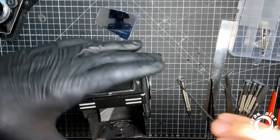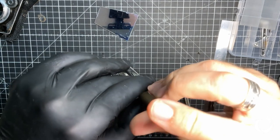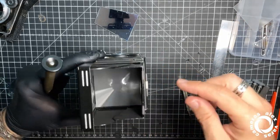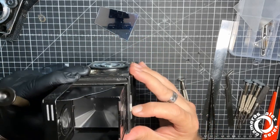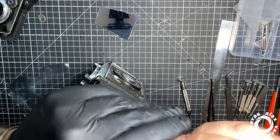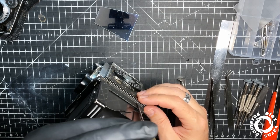These old Rolleiflexes, I mean the model 3A, 3B, have a provision where you may drop a Fresnel lens over this one. Okay, and this is installed in the finder, but you can drop one Fresnel here, because if you push this, you will realize that it catches on the corners. So you can install something different to allow better brightness, to have more brightness on the screen. Or you can put a new one.